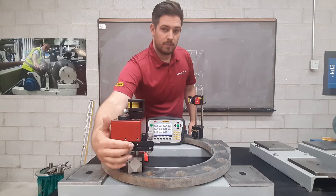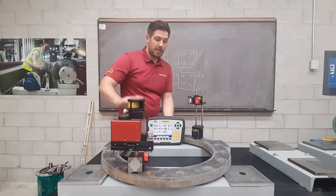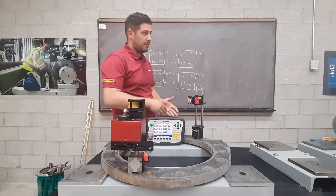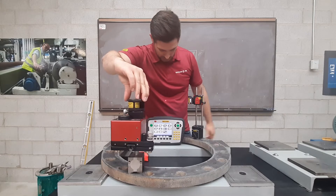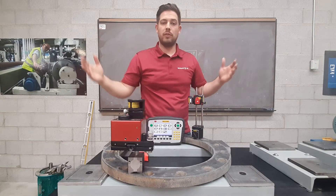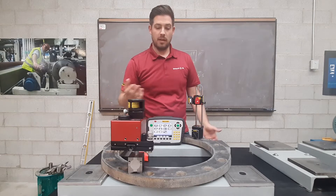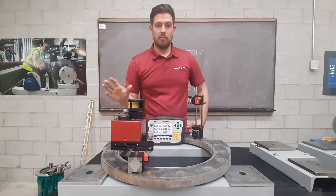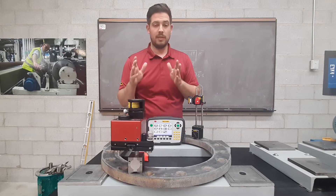We have another screw you can use to mount it on the pin as well, so you can put it on its side. If this flange was sideways, I could measure it off the side or sweep the beam that way. This turret spins 360 degrees and you can go up to 40 meters. It has a prism at the top which shoots directly 90 degrees based on the sweep or plane you've created. You can mount the D22 in all sorts of different ways depending on your application — it's the most versatile geometric laser transmitter we have.